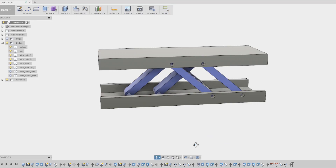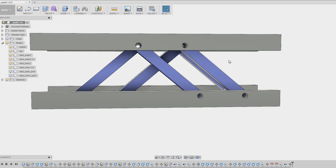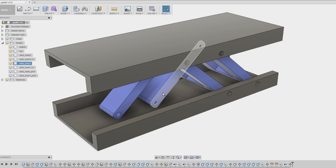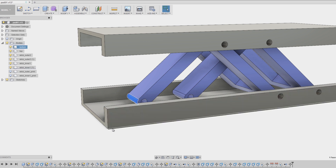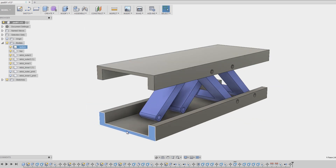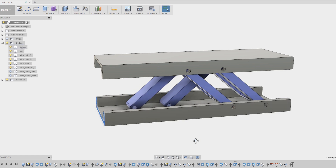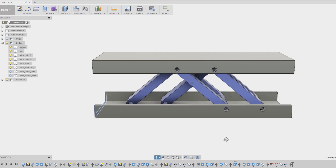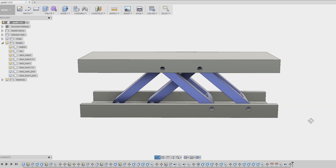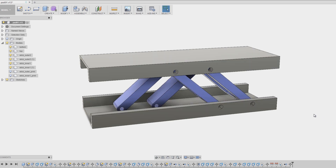So I thought I'd have a go at designing a parallel mechanism with four-bar links, which means the top will always stay parallel with the bottom. These two here have to be on runners so they move in and out, and that gives us an opportunity to put the magnet right on the end and fix the hall effect sensor on the other end. As you squash it downwards, one part will move left and right, or we could put the hall effect sensor and magnet between the two halves. Obviously we need some springs or something squashy between those two halves as well.